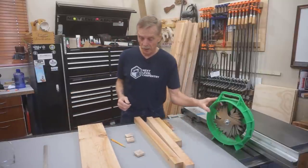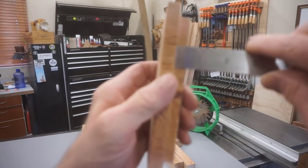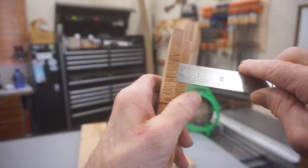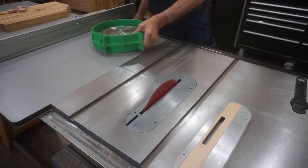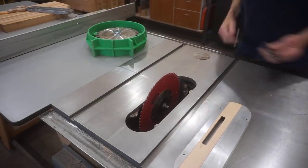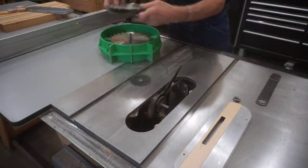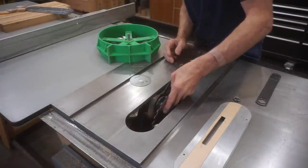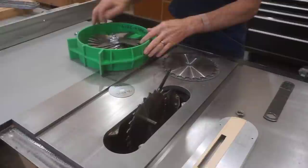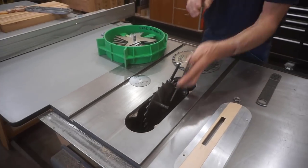The first machining step involves setting up a dado blade where the width of the dado blade is equal to the length of the stub tenon on the back of the cap, which in this case is seven sixteenths of an inch. I use a Forrest Dado King dado set, but any decent dado blade will do the job just fine. For a seven sixteenths dado I use the two outside blades along with an eighth inch chipper, a one sixteenth inch chipper, and a twenty thousandth shim to make up the seven sixteenths thick dado stack. Notice I'm careful to set the second blade on a thin rubber disc to protect it while shuffling around parts to this dado set.